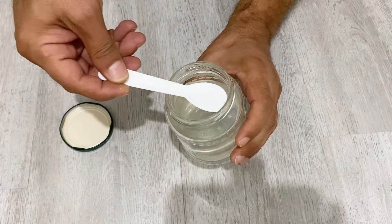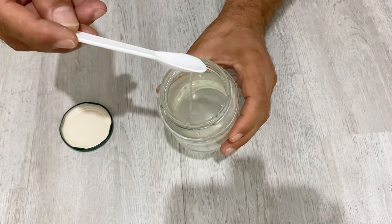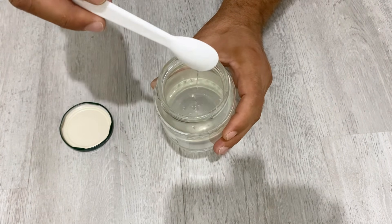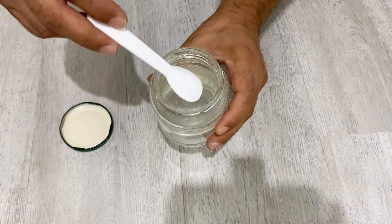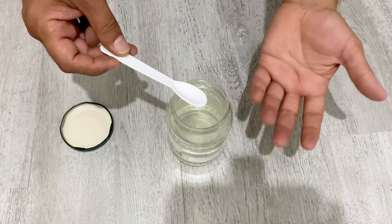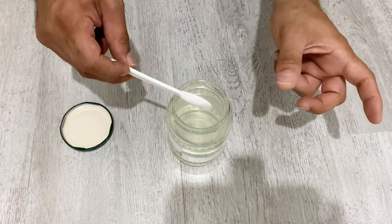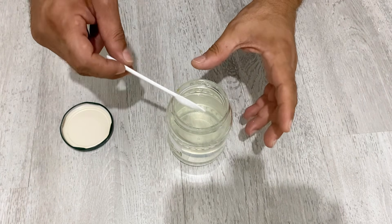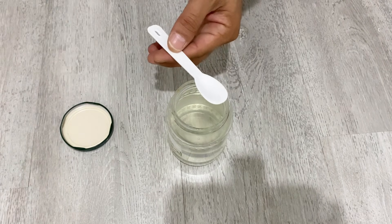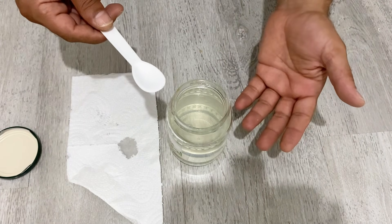This is our gel electrolyte. As you can see, you can use this gel electrolyte for your supercapacitor and for some batteries. If you encounter a problem where the sodium sulfate will not dissolve in the PVA solution, I recommend another practical approach: first dissolve the sodium sulfate in water to make a one molar solution, then add that solution to the PVA solution.